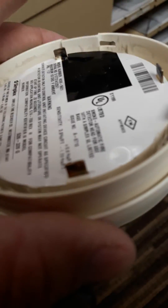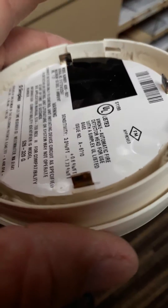We've got some System Sensor devices to keep false alarms down. The bases get this weird discoloration on the pins — I'm thinking it's happening through electrolysis. It's in place and you can see it on the pins there.